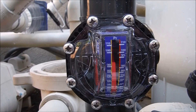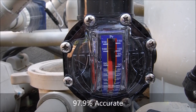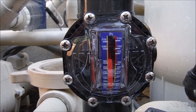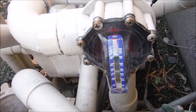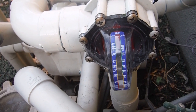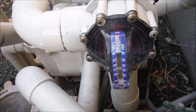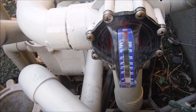The FlowViz flow meter will give you gallons per minute going through your system. Once you have that number, you'll take your pool size and be able to calculate how to set your timer for one cycle of water for maximum energy savings. You can use the charts that come with your pump to get the gallons per minute, but without knowing the actual total dynamic head — or resistance to flow — you're not going to know the accurate amount of gallons going through your system.